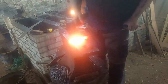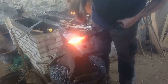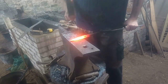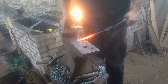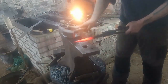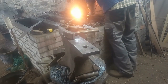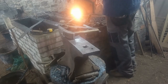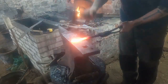I try to forge my knives to completion as close as I can get — as clean as possible so I don't have to remove as much material, basically aiming for no wastage. I'm also ensuring we've got a distal taper: a distal taper means it continuously tapers in thickness all the way to the end. At the base where the tang will be, the blade will be its widest and thickest, with a continual taper in both thickness and width. We're aiming for about 138mm in length — the length of the original — with about 39-40mm in width. Maximum thickness is 3.8mm at its widest point.